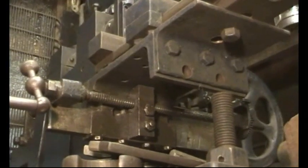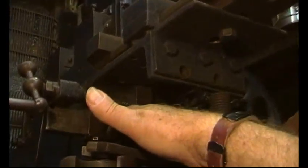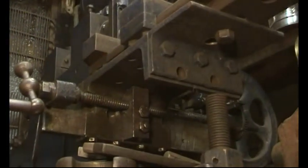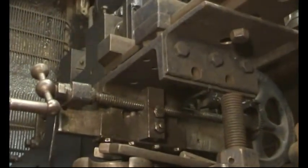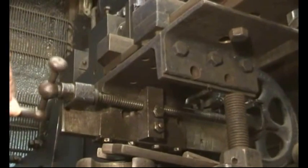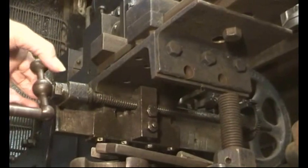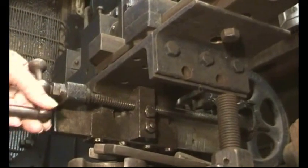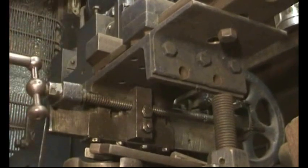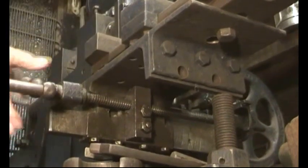So here we are — the block there. That's got the aluminium nut inside that block. You just strip that down. Do you want to turn the handle? See — it's instant response. There's only the slack in the spindle, but it's instant response. And this has been there ever since the machine was built, and it withstands the side thrust of the cutter all the time. So it does the job.